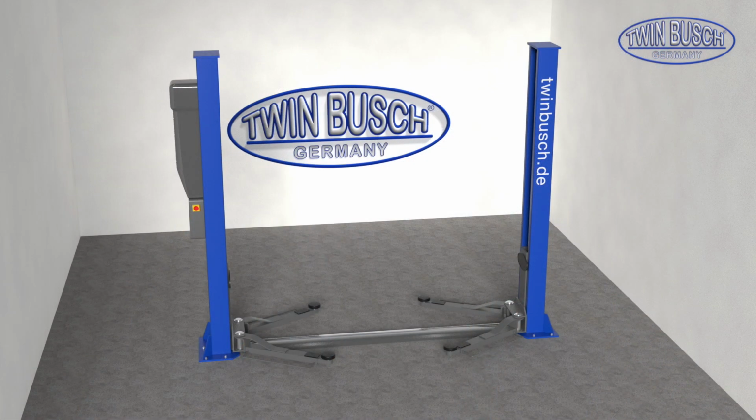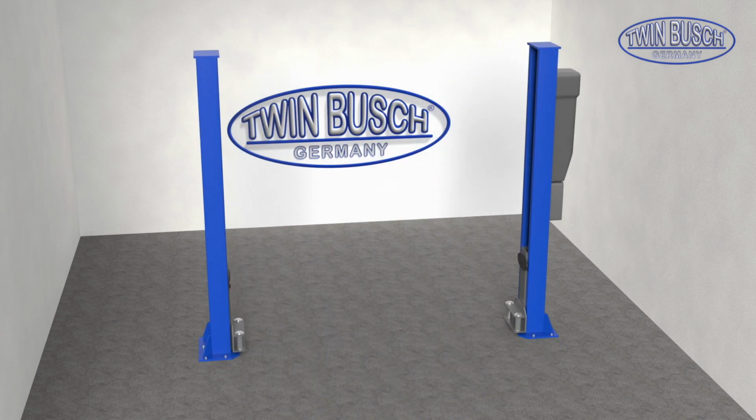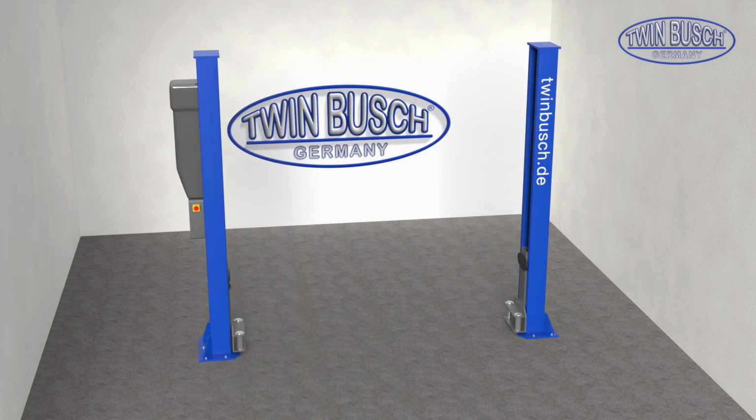Before beginning the assembly process, you should consider the position in which you will be placing your Twin Busch lift. First, you will want to decide where you would like to position the main post, which houses the motor and control units. Keep in mind, the position in which you place this column is where you will be operating your lift. On this side, you will need some space for operation. Also from this side, you have the electrical connection, which if possible, is better from above.